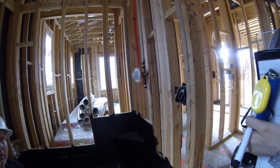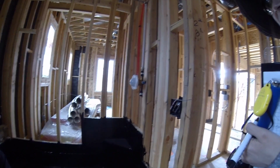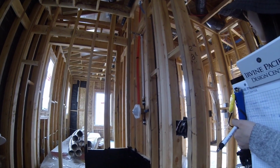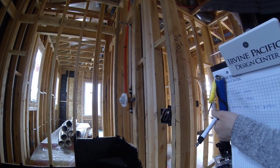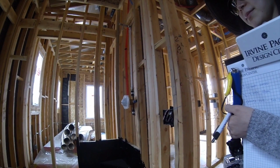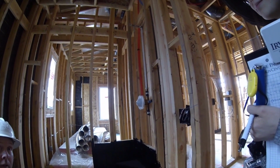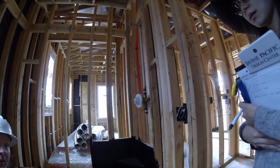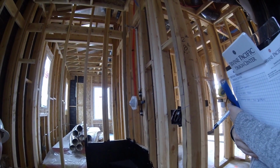It's nothing but a big sponge. It stops absolutely no water whatsoever. The black paper underneath there, that's what stops your water. And there's a science to putting it together, because that black paper is not waterproof. Water will seep through it over time. If you get, like we were talking earlier, a slow, steady rain, water is going to get through that paper. But the way it's lapped, it's water resistant, not waterproof, but the way it's applied, it directs the water away from your house. That's the whole concept behind it.